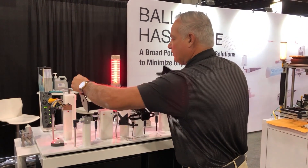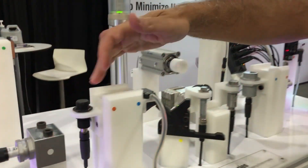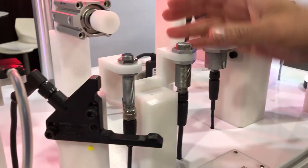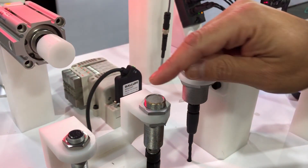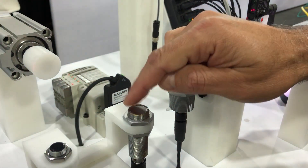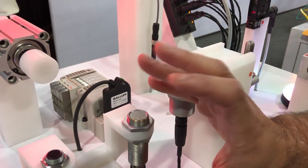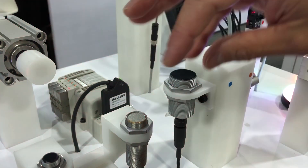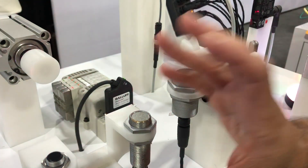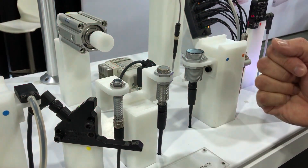Taking it a step further, we can pull this hitch off of here, and you can see where we have different simulations of proximity sensors — different fit and form factors. For example, here we're using what we call a self-bunkering prox. You can see the feature on this sensor where it's countersunk down in there, and this is actually a deflection ring. When you're not able to use bunkering or don't have the real estate to put more protection on a sensor, this is your sensor to go to because it will actually deflect the impact on that sensor.